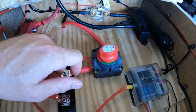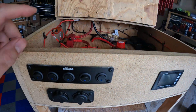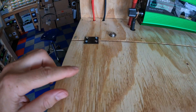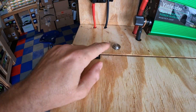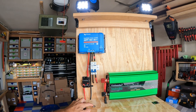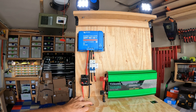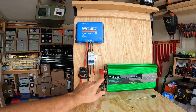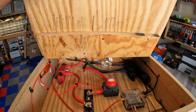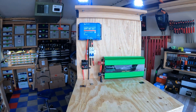There's my battery disconnect switch — that's off now, and nothing works. But let me show you: the battery is off, and my little momentary-on button works. I'm going to slightly press it — and it turns on those lights. Just enough to pre-charge the capacitors in that inverter so I don't get any sparks. Then you can turn on the battery cutoff switch cleanly.